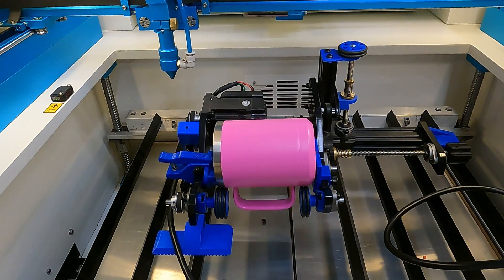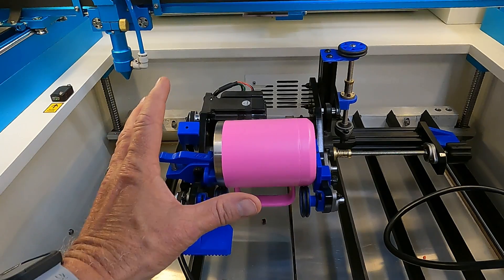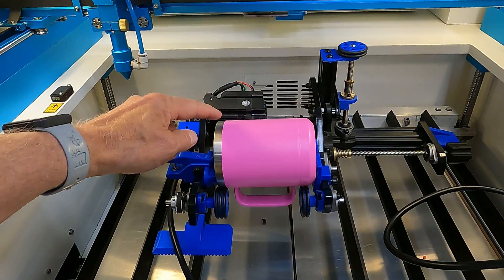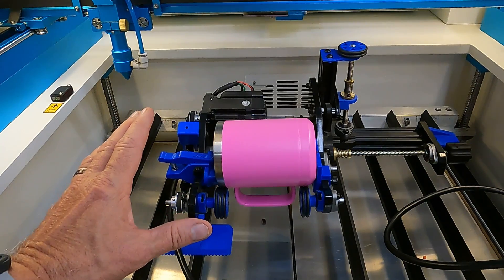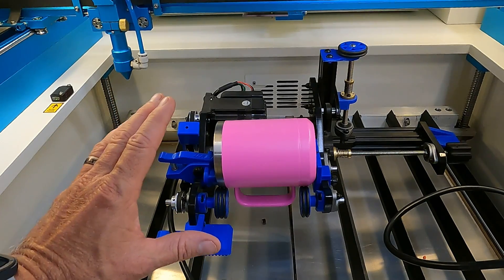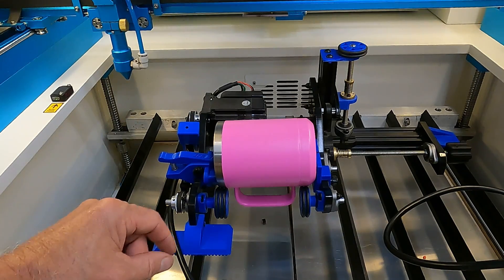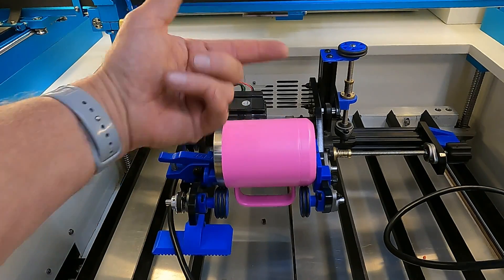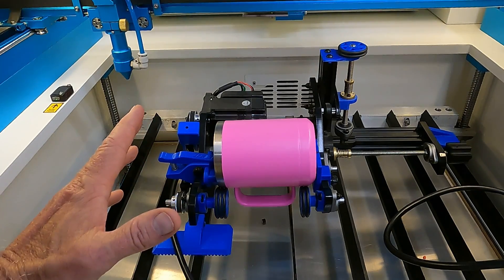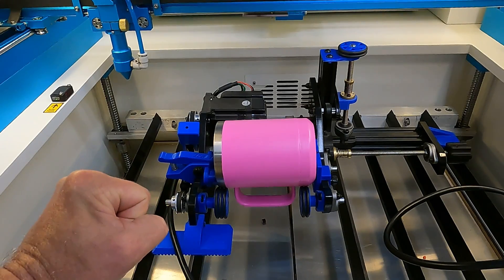You can see there's no possibility of a head strike with the way that handle moves. Now that I've verified the template is correct and I haven't made a mistake in my setup, I can go ahead and drive the laser back, set the origin, make sure the rotary is in line with the gantry, and crank out the cups. The trick of it all is to put that laser head over to a safe spot first, set an origin, and verify your setup is correct. As many cups as I've done, if I'd just been on autopilot the cup handle would have definitely struck the laser head. It's just a good practice to get into. I hope this information was helpful — please like and subscribe, and you guys have a great day.